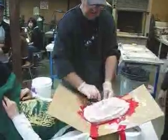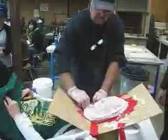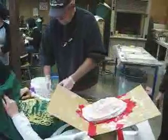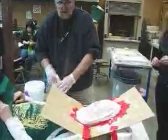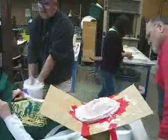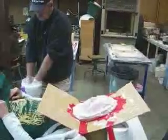You can continue this alginate mold, build it up, make it thicker, or continue and attach it to this. So the alginate molds don't last really long, right? You can keep them in plastic bags and seal them off so they don't dry out. They last 2 or 3 weeks, but they'll start to grow mold. Organic material, they'll start to grow mold.